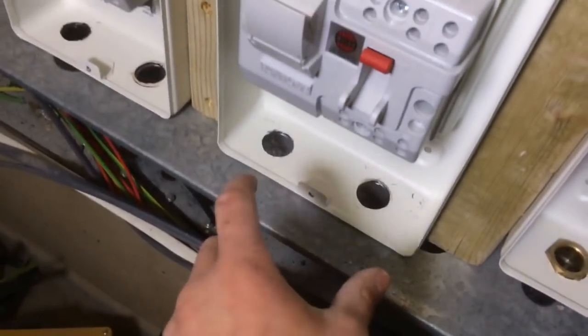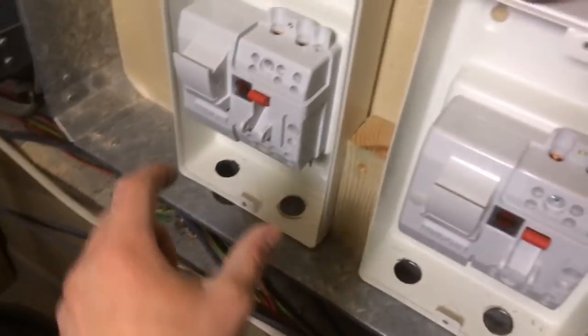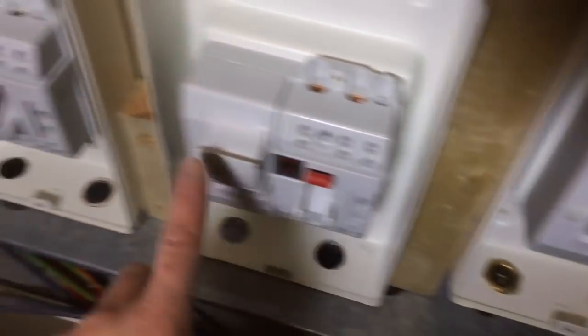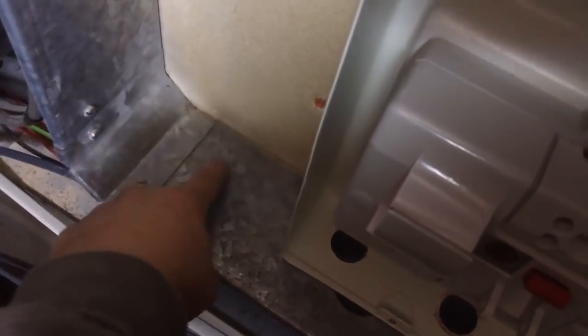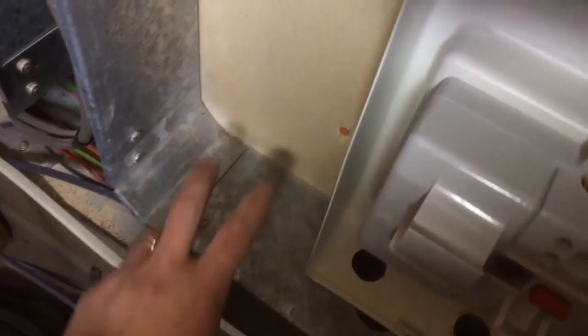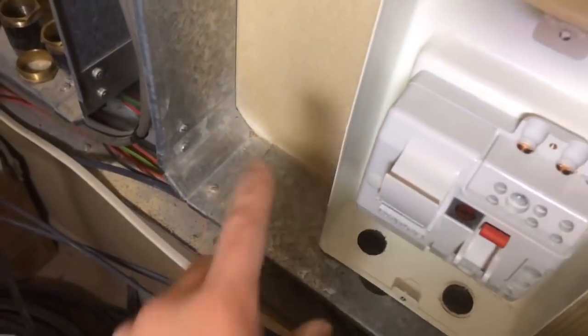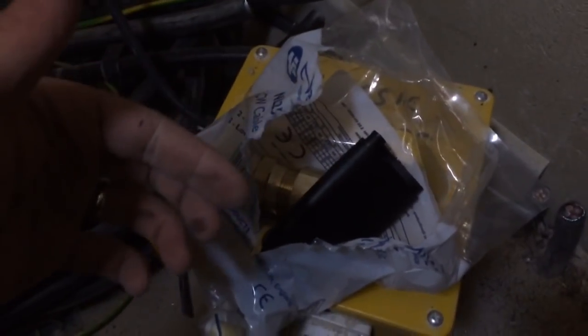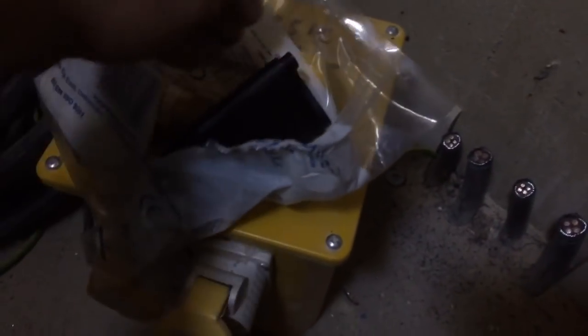I've now just got Philip waiting for the bushes and couplers. I've drilled all the holes, got them all in the right place. I've used a piece of timber just to space these out — two inches — so it's all equal and I've got enough room to drill out the four armoured glands where they're going to come in. I'll show you what you get in an armoured pack if you've never done it before.